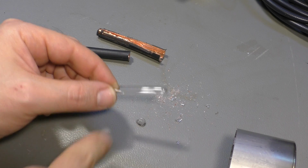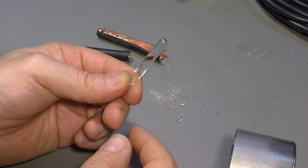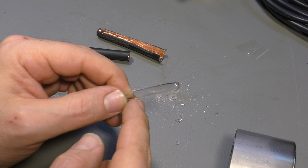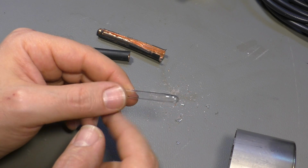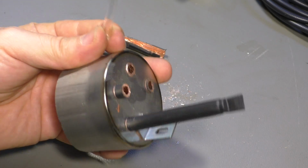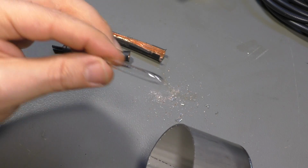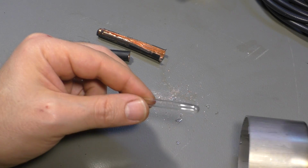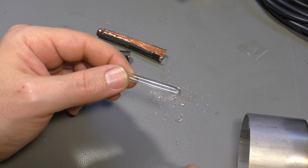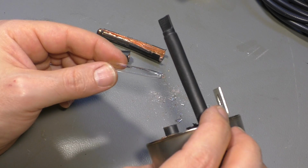and according to some other people who know a little bit more about argon lasers, this is a reservoir filled with a little bit of argon, and every 1000 or 2000 hours you have to crush one of them using your pliers to release the argon into the tube. So it seems to be necessary to do that every couple of 1000 hours or hundreds of hours, something like that. Okay, that's the mystery of these tubes.